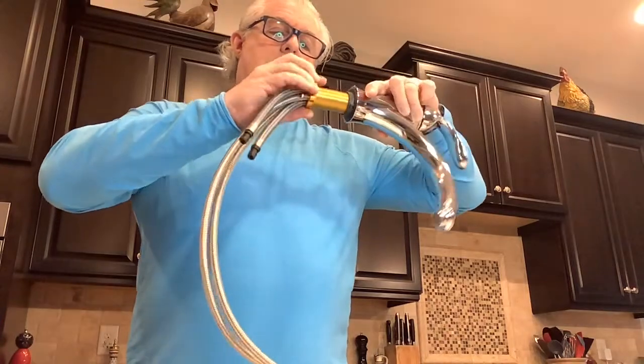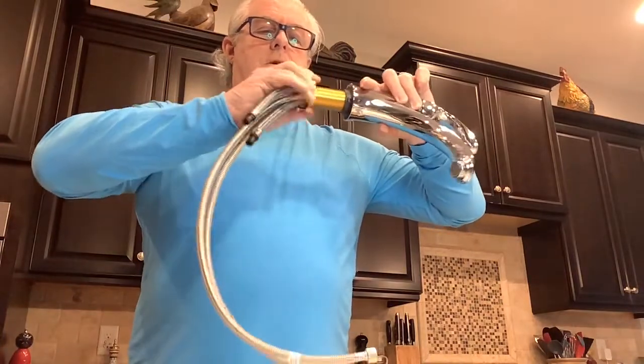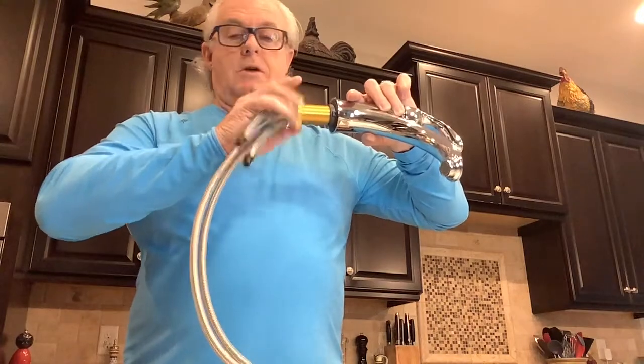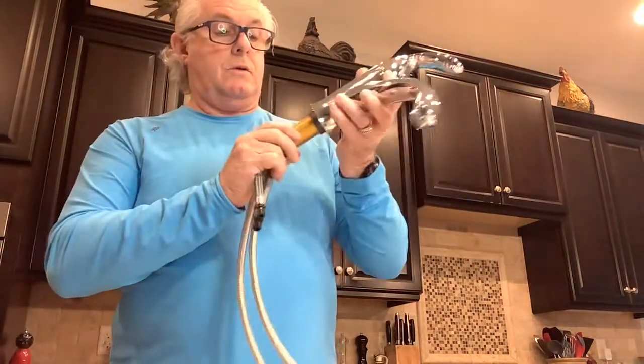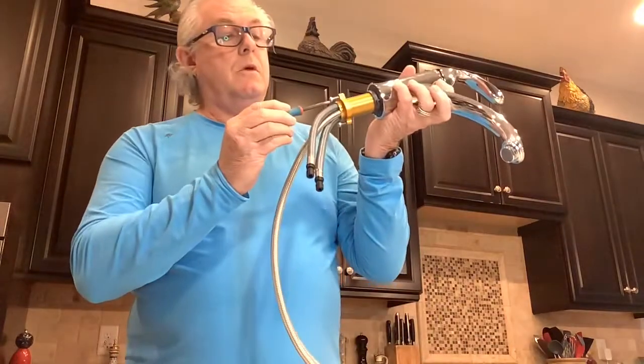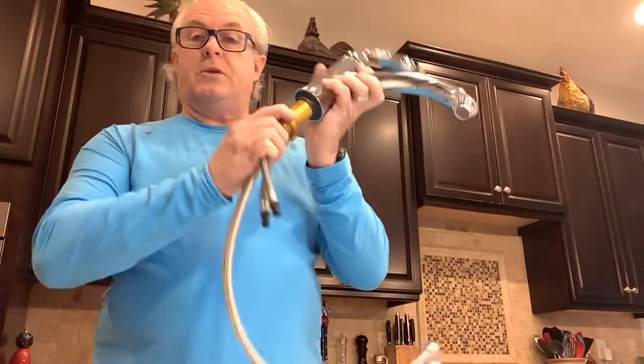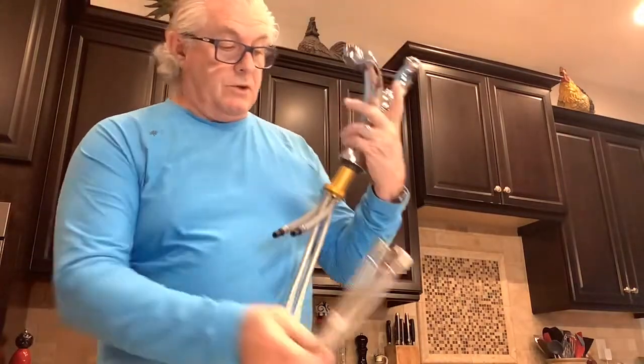Get the hose sorted out, then put it on. When you get it up close, tighten the screws with a Phillips head screwdriver, and I would torque them like you would when changing a tire on a car so that the faucet doesn't sit cattywampus on top of your kitchen deck. Once that's done, I'd recommend putting the rubber gasket on first and then the metal washer as it comes out of the sink, giving you a good base for the screws to tighten up against.